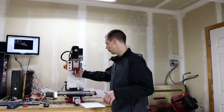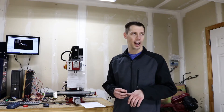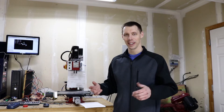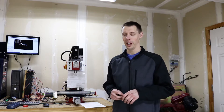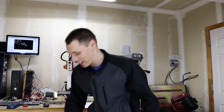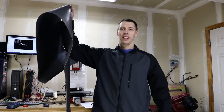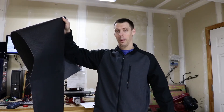I was thinking of going on McMaster-Carr and spending $20–$30 on some fancy rubber that's grease resistant, and cutting a piece to run from the bottom of my spindle over to the back of my saddle. Then my father-in-law suggested using the belt from the old treadmill I had. I said, what are you talking about? He said, what about the conveyor belt on there? I thought, that's a pretty good idea. It might not hold up to grease and oil as well, but it's free, and there's a lot of it — probably lasts me a year just replacing little pieces. So tonight I'm going to try and cut and fit a piece of this stuff on there. I think it'll probably hold up for quite a while — my free solution.